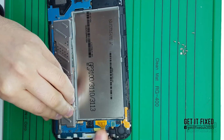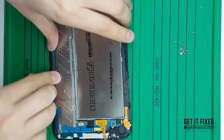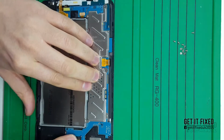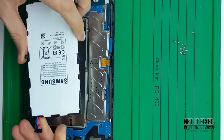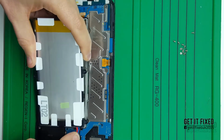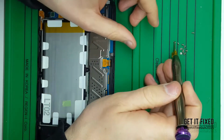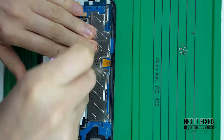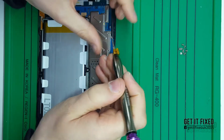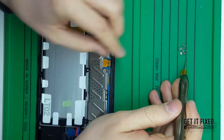If in 10 minutes it's not charging more than 5%, it means your charge is quite slow, quite weak. But in this case, if you got 5% in 10 minutes, that's quite fine, nothing to worry about. You can give the tablet back to the customer, everything is okay. You might need to sell them a stronger charger.